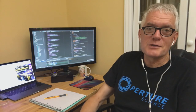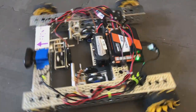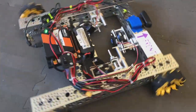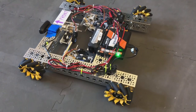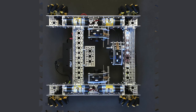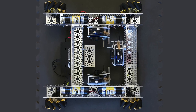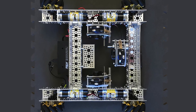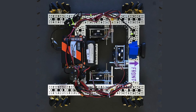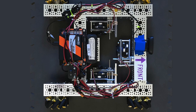So let's look at the details. This is a Strafer chassis from goBILDA that we have passed around between the members of the software team, and it made it to my house at some point in the fall. The four drive motors are tucked into the channels that make up the chassis. The motors are powered by the REV controller, but no encoder cables are connected. Instead, the three Odopods are plugged into the encoder ports on the REV controller.